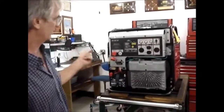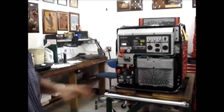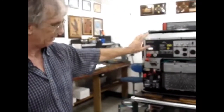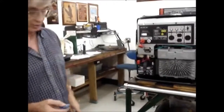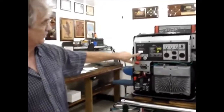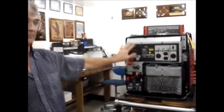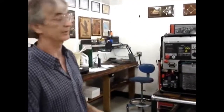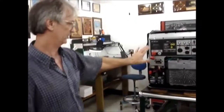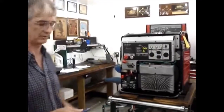In order to arm the system, you turn the key on. And now everything's armed. But if you don't want to run the generator yet, but you want to conserve battery life, you would hit button number 2. You'll notice that shuts off the fuel injection computer, so now the only thing that is live is my radio. It only pulls about 25 milliamps, which with this battery, you'll have a couple of days of standby power, as long as you have disarmed the stock fuel injection computer.